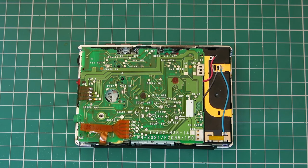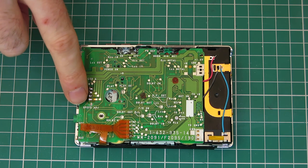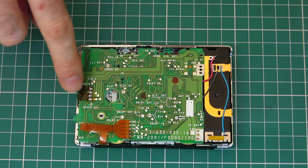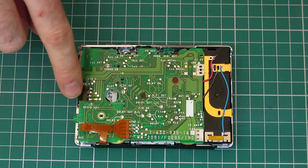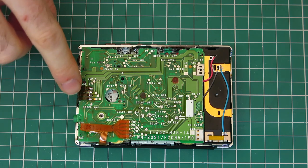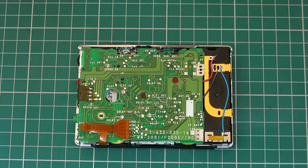Alright, some progress has been made. I had to do quite a bit of work off camera because there was noise in the house. Some of it was just really fiddly and wasting a lot of the camera time. So what have I done? The ribbon cable's been soldered to the motor and soldered back to the board. This took a couple of attempts to get it back to the board, because if you don't quite get one of these solder joints flowing properly underneath the ribbon cable, the power supply will act as if there's a short on it, more or less. So I had to go and reflow these again, and then I got the motor to run. It's lucky that the power supply is current limited, but it immediately started drawing 500 milliamps, so that's obviously not right.